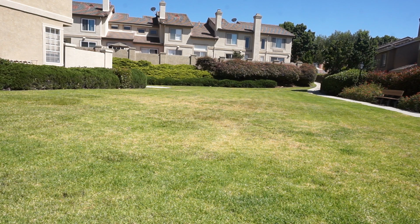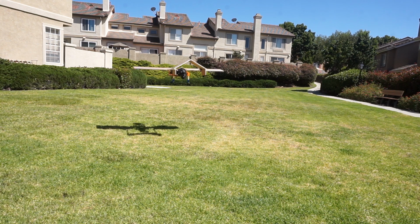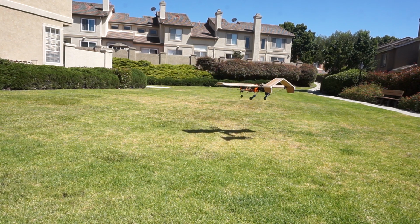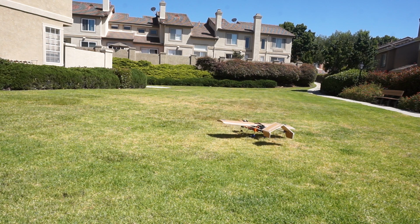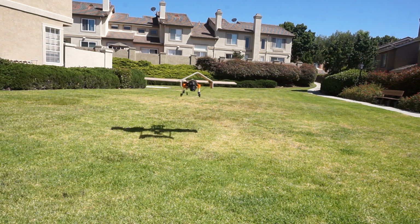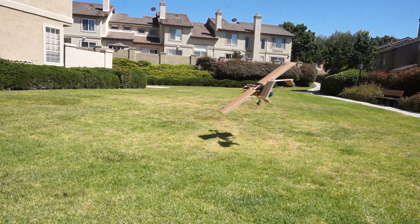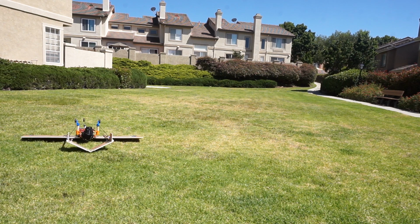I've ordered some 50mm ducted fan rotors to replace the 2-inch propellers on the roll thrusters. I'm going to replace those motors with something a little bit more powerful, and that should get the thrust of the roll jets up from about 400 to 500 grams closer to 900 or 1,000 grams. But at the same time, since the 50mm fan rotor is about the same diameter as the 2-inch propeller, it's not going to take up a whole lot of extra space on the airframe. We'll test that, we'll see if it works, and then if so, we'll roll that change into the plan for the full-up F-35.